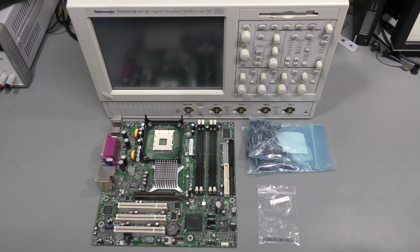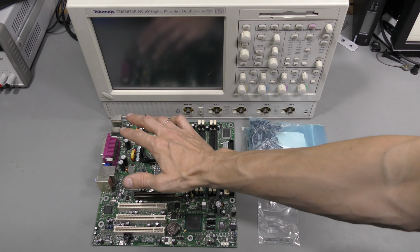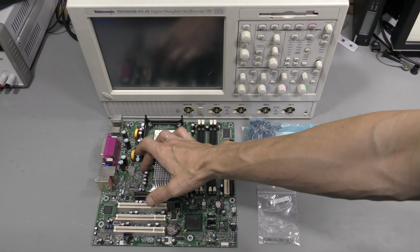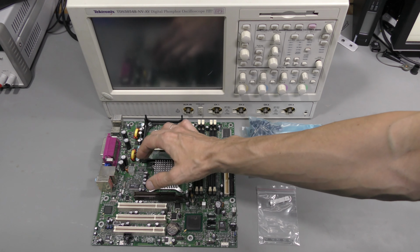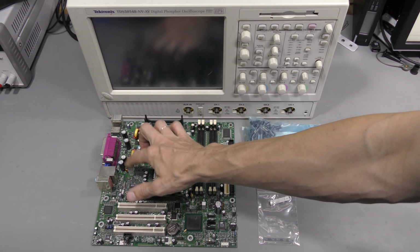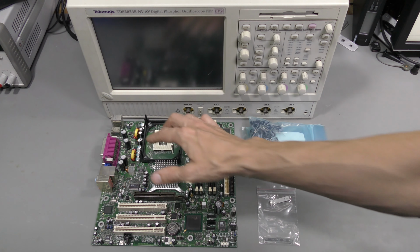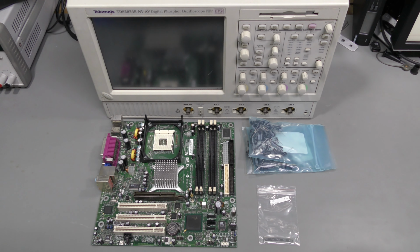And as I showed in my previous video, it tries to start for a brief moment, and I tried capturing that moment on an oscilloscope, and that way tested some power rails and so on. And I believe that the CPU core power rail does not start, so I blame this step-down converter chip. It converts a 12-volt rail into that CPU core rail, let's say about 1.5 volts. And that doesn't seem to work.